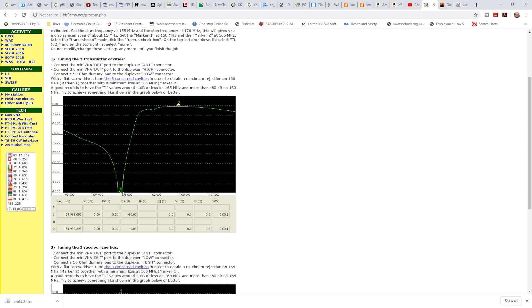This is actually quite a useful document — it goes into some detail on how to tune it and gave me really good ideas on how to connect the VNA. It also informed me that I have to terminate the other end. I thought I did, but I didn't know whether I should short it or use a load. All the instructions are here, which is really good. The software is a bit limited — there are probably better paid packages.